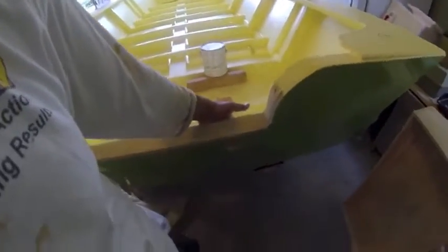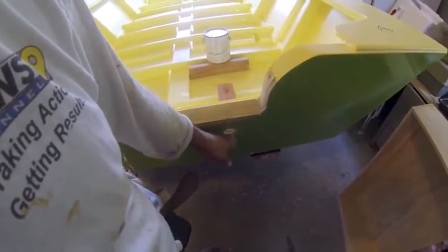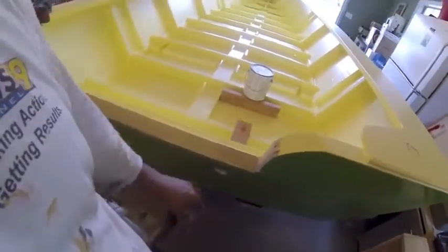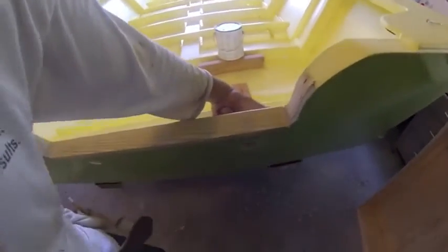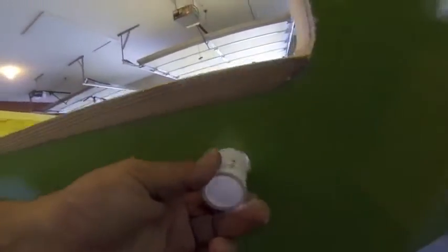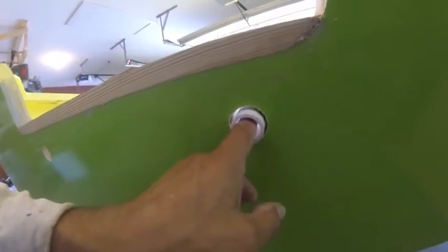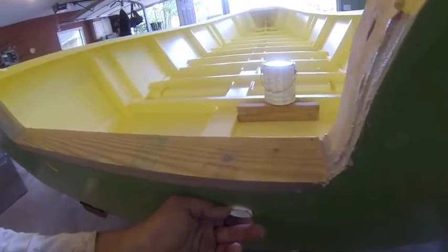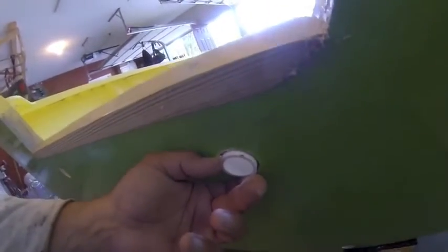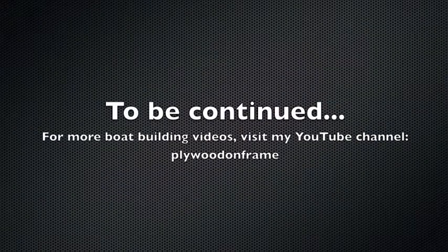When you drill this, drill from the inside or out — doesn't matter — until you get all the way to the point where the drill bit just shows. Then turn around and go back in from the other side. That way I don't blow out wood or glass while I'm doing it. Once that tip comes out a little bit, just flip it over and go in from the other side. PVC pipe — I drilled the hole a bit big, but that's because I like a lot of material around it to seal it up. I'll set it in there, sand it down, rough it up — it's already rough. I'll leave it a little proud, and depending on how it finishes out, I'll either leave it proud out the back or sand it down before my last coat on the outside of the boat.